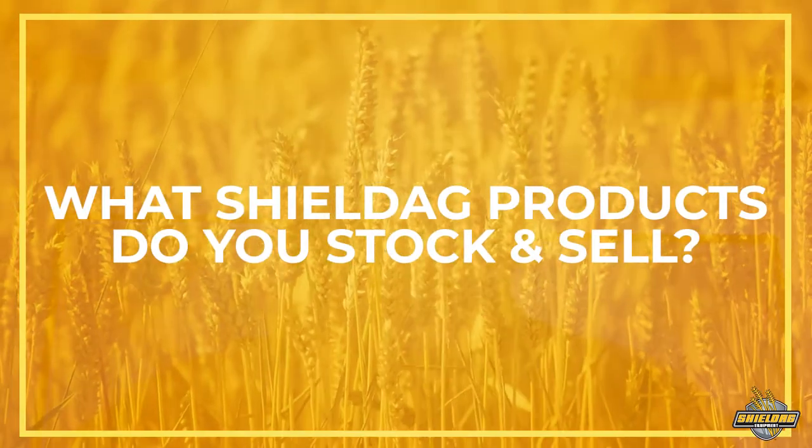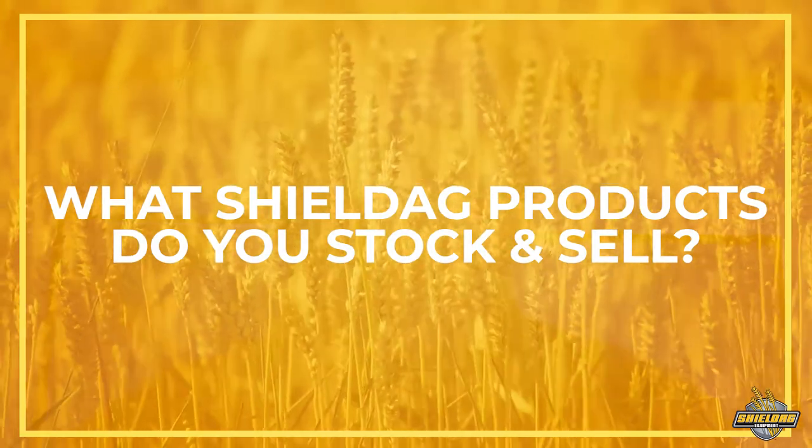That's what got me thinking about making anhydrous ammonia toolbars. We are currently selling the SHIELD row units. For anhydrous ammonia, we're basically taking the CS style shank and the split mount shank. The CS style shank is a unit that mounts where there's a coulter blade and a shank, and they mount to the same tube. The split mount is where the coulter is mounted to the front tube on the frame and the shank is mounted to the rear part of the frame. We're getting the shanks and also the knives from SHIELD.